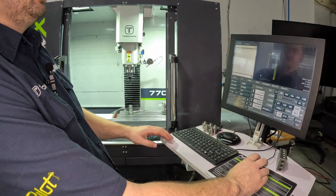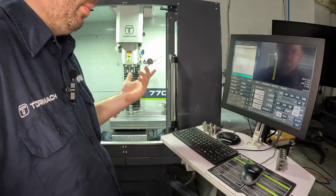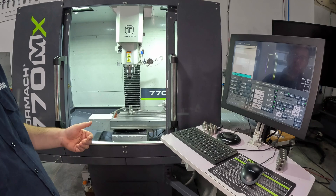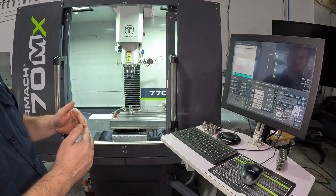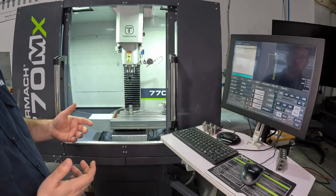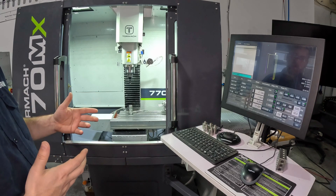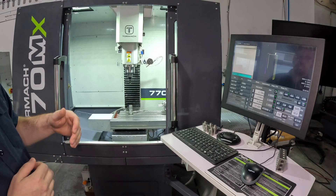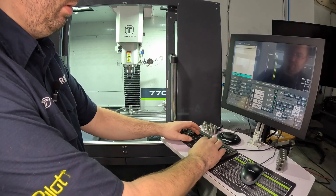We have one final argument you can give to a G37 command: G37 E. With a value like 0.005, this is also going to be a small value. I will specify that E is not currently released in PathPilot — this will be added with a future release. What E does is another form of checking the tool length, but E specifically checks if the tool is longer than the previous value, rather than shorter or longer like P. There may be situations where you want to specify different values for a tool being shorter versus longer, so this just gives you an additional option since those two scenarios have different circumstances. You can also combine both P and E in the same command.